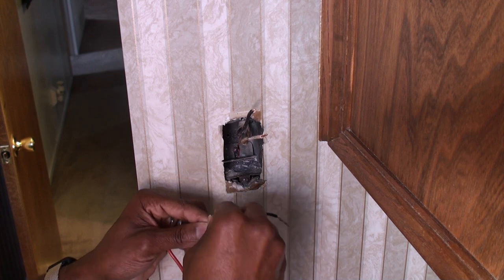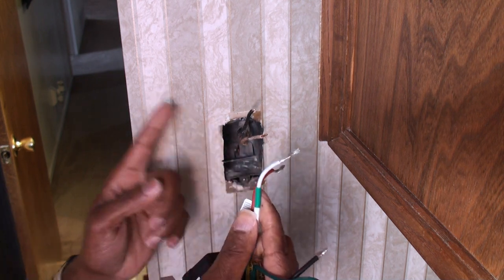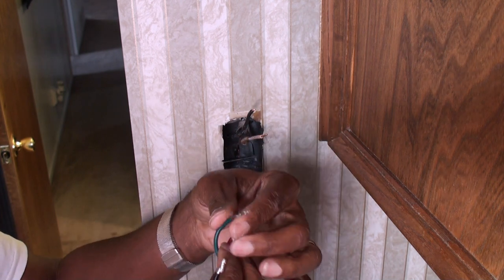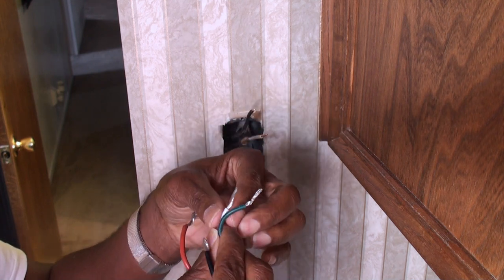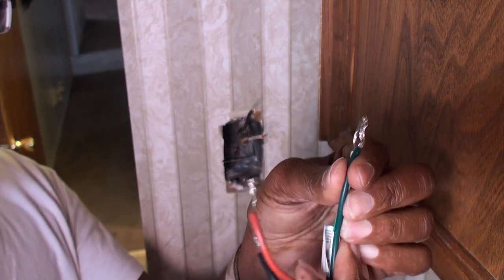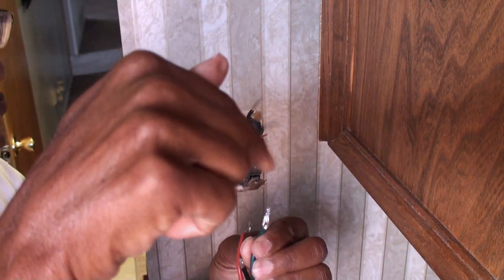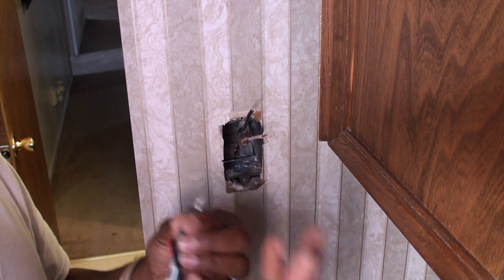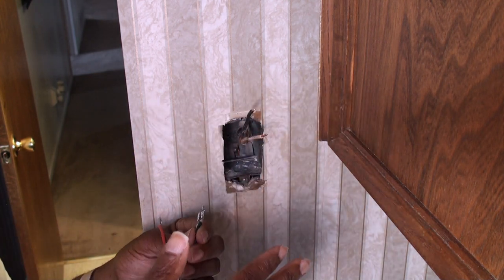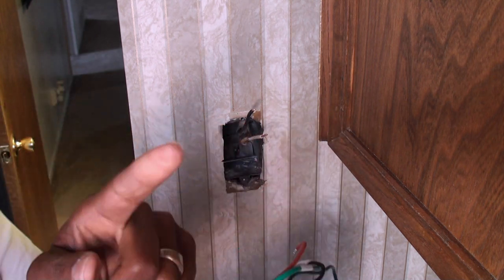Now the magic to the whole thing is this white wire, which would have been hooked to common if there were actually four wires in the outlet. What you do is join the white wire with the ground wire — put those two together and you have it working. There would be a video link below from a guy who explains why — it has something to do with homes built after 1985 versus those built before 1985. I've already tried it and it works.